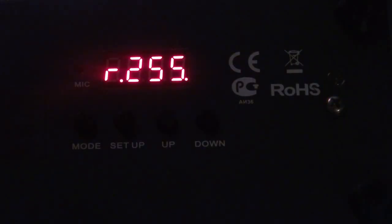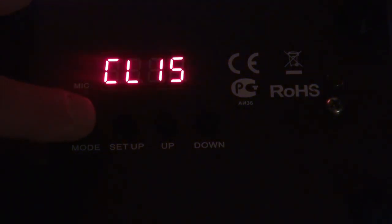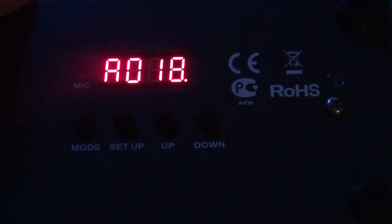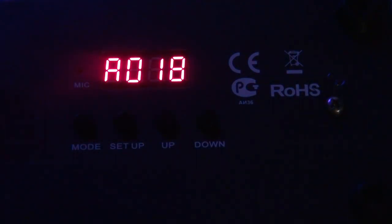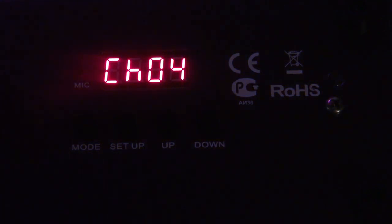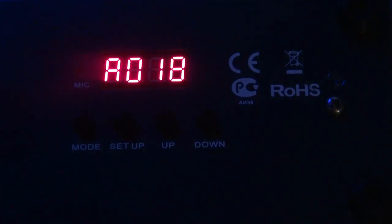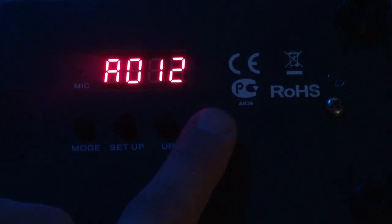A lot of you are getting into this kind of stuff for the very first time — you go out and buy equipment and you're not sure how to hook it up. So I'm going to show you how to address your lights and use this system with an American DJ quad LED. The first thing you'll need to do on all of your fixtures is make sure they are in channel 4 mode. On this particular light, hit the mode button until you see the DMX addressing screen, then hit setup once to get to the channel mode screen. If it's on channel 8, go down to 4. Each and every one of your lights needs to be on channel 4. Then go back to the addressing screen by hitting the setup button once. If you want everything to run the same way all night, I'd recommend addressing all fixtures to channel 1.